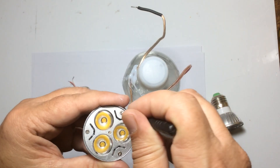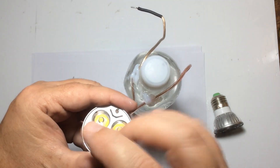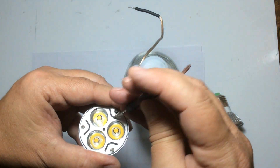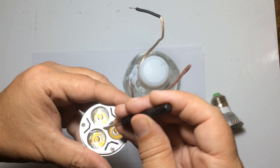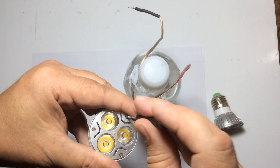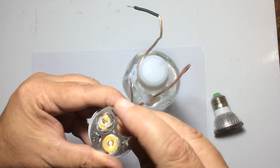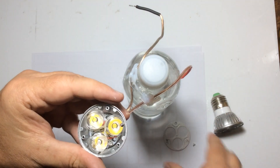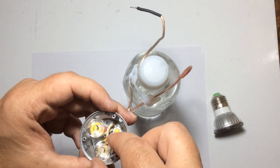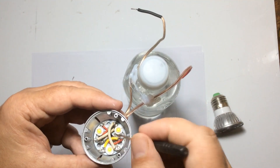This is the one I have converted. We remove those screws, then there's a small metal plate that comes off, and then three focal lenses — because the LEDs on their own have quite a broad area and need to be focused down for any real intensity. This screw is difficult to get out. So it comes out and then we've got these three focal lenses — remove them. They're cool to keep, so if you have lights like this that blow up, don't throw them away. A lot of the time the LEDs aren't what blows up, it's the internal components.